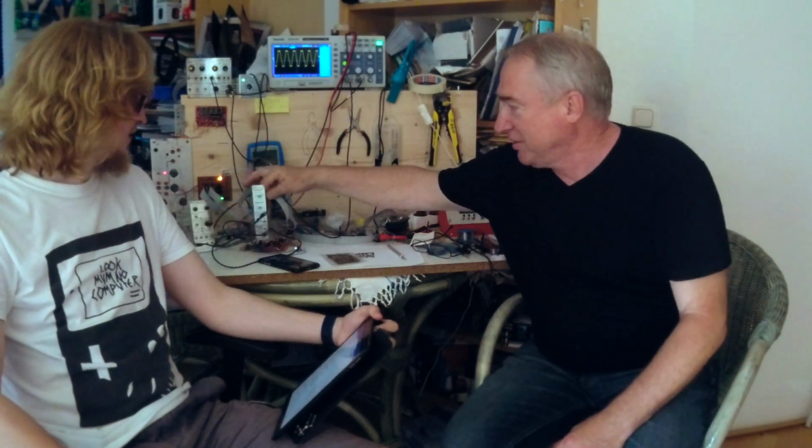So finally I put it aside and we started something else. And now it was about time to get it out of the grave, take a look, and within the first 5 minutes I found what I did wrong. I forgot one resistor at the input op amp. You had it going in like one afternoon on Sunday or something. Yeah.